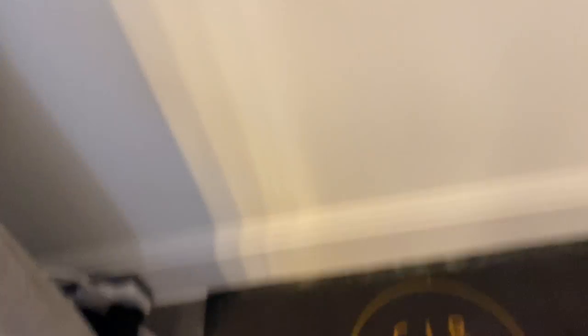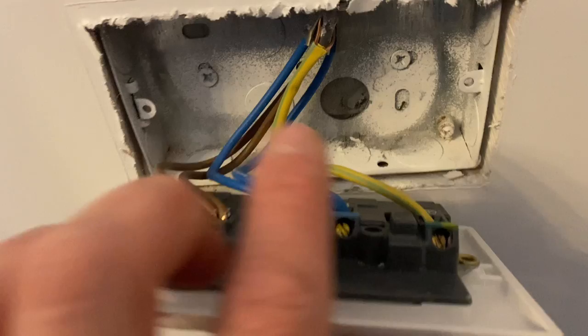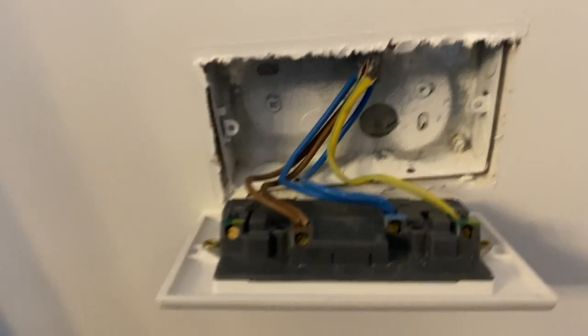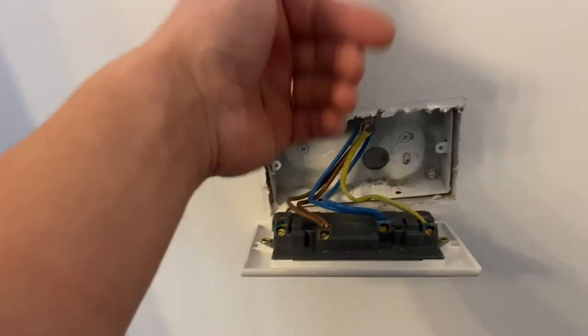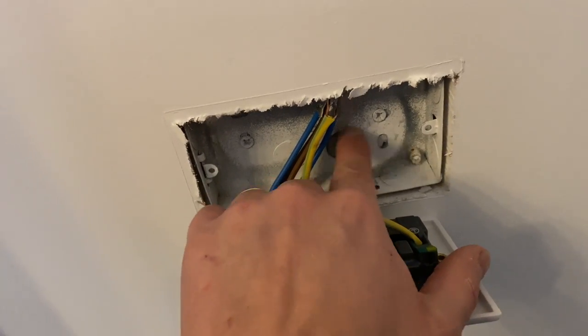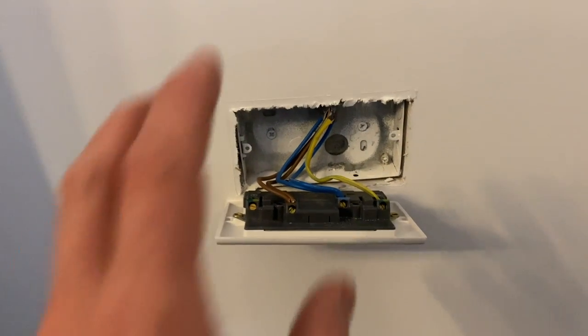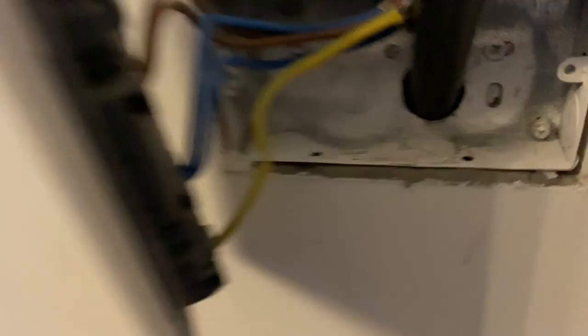Next job on the list is an outside socket for Christmas lights. We've got a double socket here - it's on exactly the same circuit as we just worked on upstairs, which is nice. We'll do our test here, untwist these twisted-together earths and put them in a separate sleeve, even put a back box earth on there. We're going to drill out with a 10mm bit first and then back drill with a 25mm, and bring some 25mm conduit pipe straight into the back of the socket. I've got a BG socket - I can't get MK, they haven't made any, so there's a three-week wait on the MK with a timer, so all I could get was a BG which is absolutely fine.